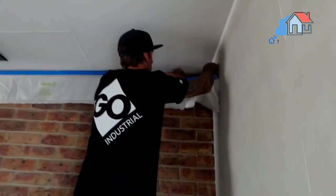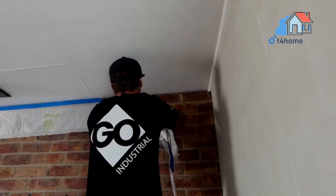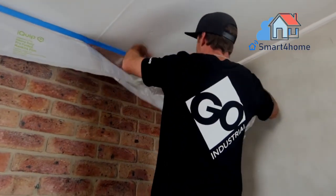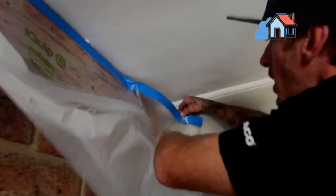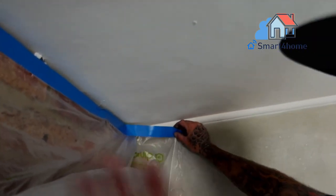How do you prepare exterior brick for painting? It's important to thoroughly clean the brick before you paint it. Use a wire brush and soapy water to scrub the brick and remove any efflorescence — those streaky white deposits — or dirt. If you're having trouble getting the surface clean, you can apply a mixture of trisodium phosphate, TSP, and water.